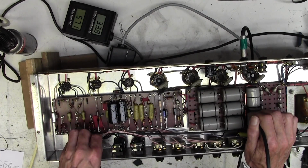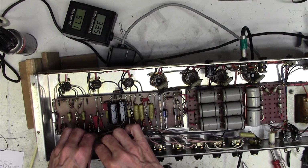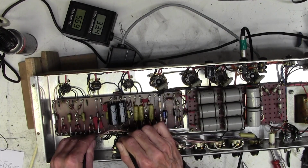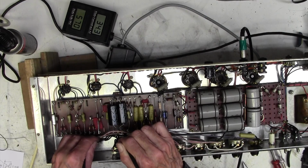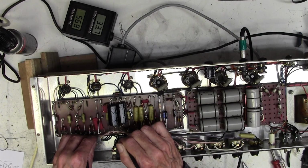And yeah, if I go onto there, let me see, no, shorting that doesn't do anything. If I go from here to here, yep, that kills 75% of that residual hum. Isn't that astonishing? Whereas this doesn't have any effect whatsoever going on there. No effect. And on this earth tag, 75% reduction. Go figure that.